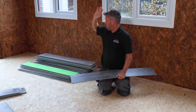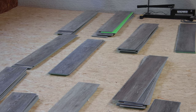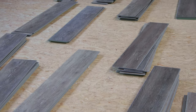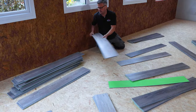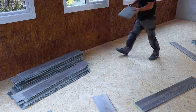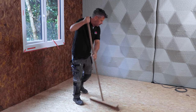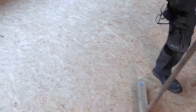I'm going to make a start from the left-hand corner and work my way all the way across to the right. You might find when you take the planks out of the packaging there is a variation in the shades. So it's worth mixing these up, giving them a good shuffle around before you start to install them. Once you've done this, prepare the surfaces by cleaning up any dust or debris, making sure it's dry and flat, ready to lay the boards on.